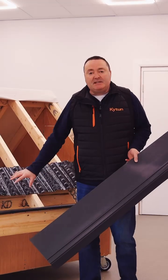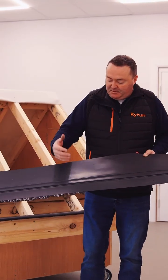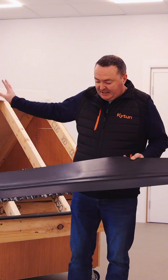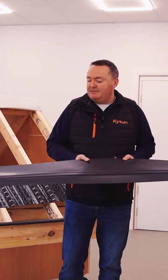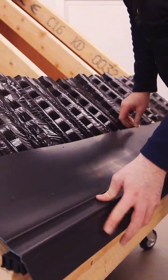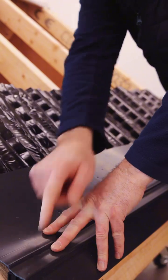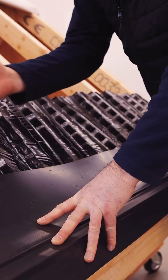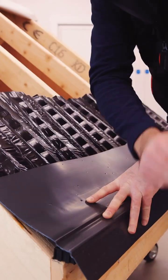So we've got the eaves ventilation in place. The next step now is to provide an eaves protector so that any water from the top of the slates or from the roof underlay — if you've got damaged slates or tiles up the roof — can run down and drain safely into the eaves gutter. The roof underlay will come to about here, and any water draining out from the roof cavity can drain safely into the eaves gutter.